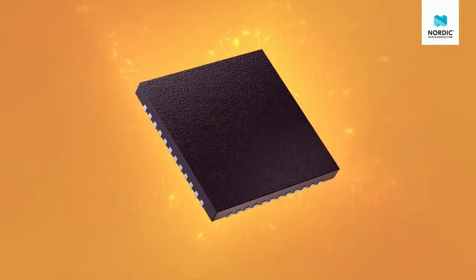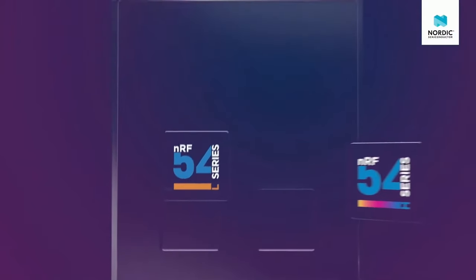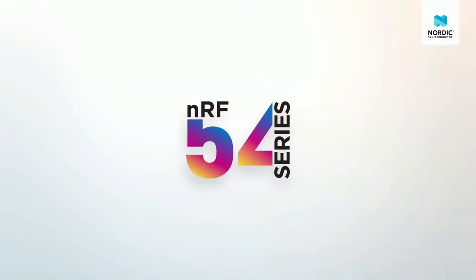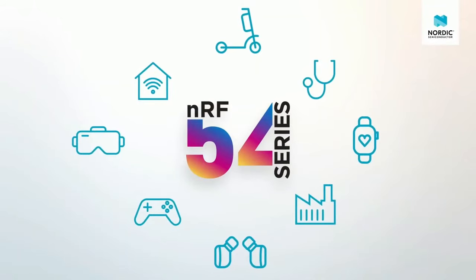Security. Today I'm very excited to introduce the NRF54L15, the first SoC in the NRF54L series from Nordic Semiconductor. The NRF54L series complements the NRF54H series and covers a different set of end-product requirements. The NRF54L series targets the next generation of IoT products, while the superior processing power and ample memory of the NRF54H series enables innovative IoT products previously not possible. Together, they cover an unseen range of wireless applications, from simple sensors to advanced IoT devices. The NRF54L15 integrates an ARM Cortex M33 running at 128 MHz, doubling the processing power of the NRF52840 while reducing power consumption. It has 1.5 MB of non-volatile memory and 256 KB of RAM.